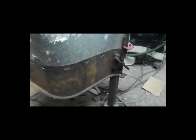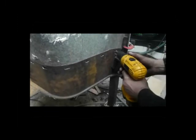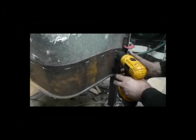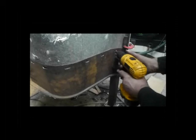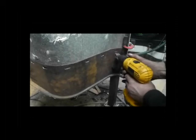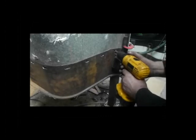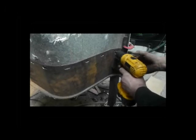One of the things that I forgot to mention was that cast iron can be quite hard. This had an area that was hard in the surface, but it should be okay to tap, and I tap using my cordless.